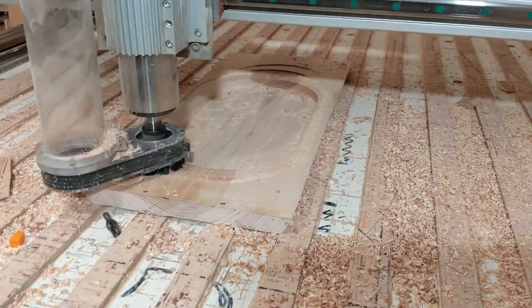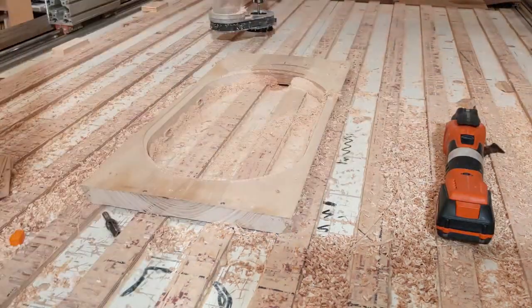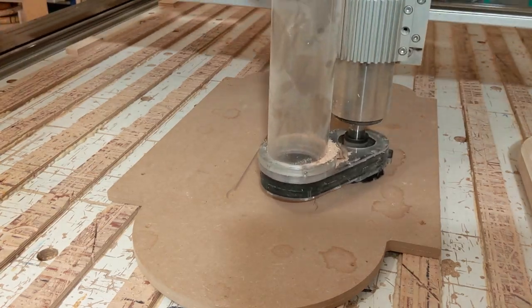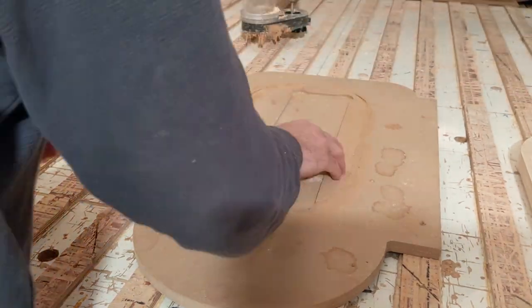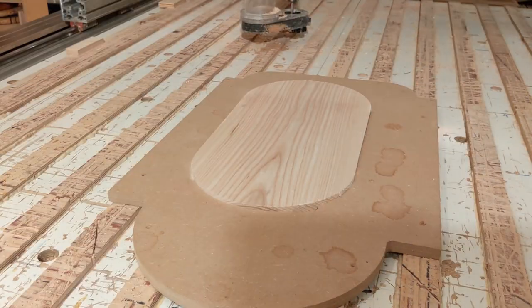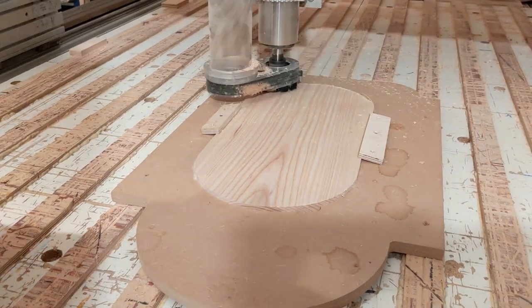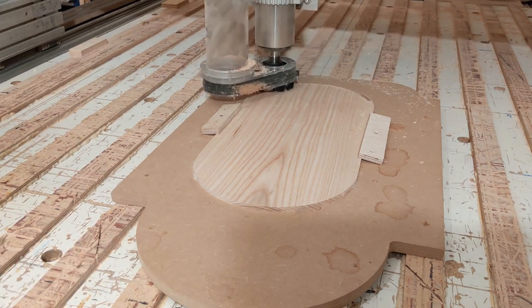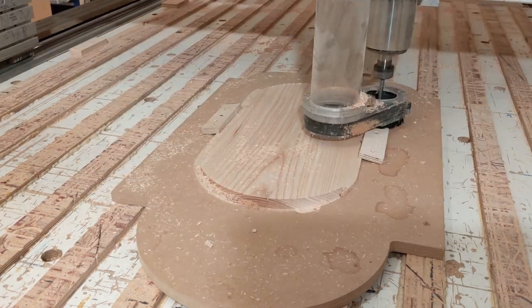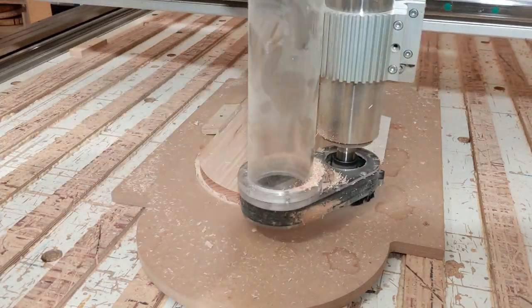On the next step, what I'm going to do is make a jig, which is really quite a simple jig. It consists of just the outside shape of the tablet, which I put the tablet in. Then the machine knows exactly where the tablet is. That way the tablet is fastened upside down and I can route out the bottom of the handles. And that's really it — the routing is done.